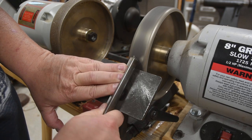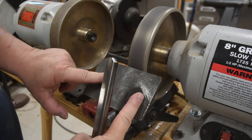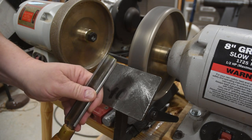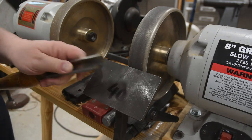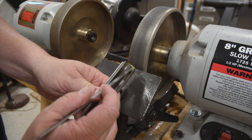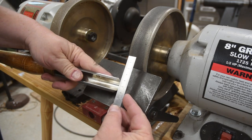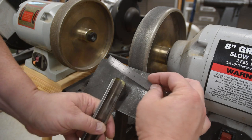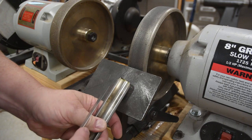Normally, because I have the platform set and never touch it, sharpening is just a light touch across and back — then get back to work. But here's what happens over time: nobody's perfect, and sometimes you might grind a little bit more in the middle than on the wings. Over the course of maybe a dozen sharpenings, the center will come down further. What you actually want with a spindle roughing gouge is for it to be perfectly parallel across the face — it might drift forward a little, or back, or cant one way or the other. That's how you reset it.